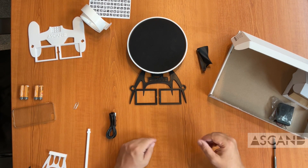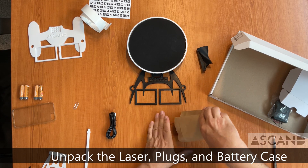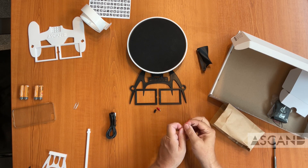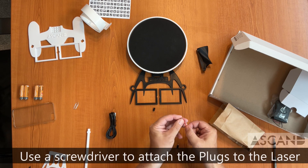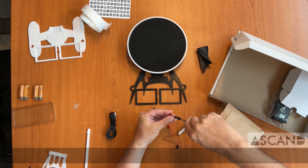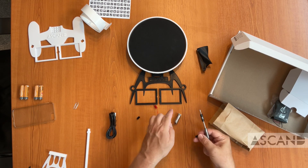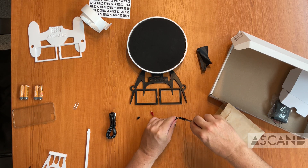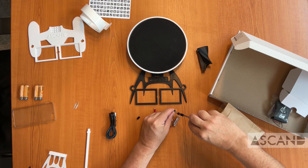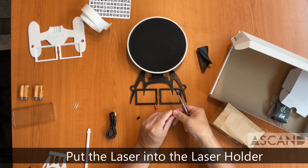Next, get the laser attached. Grab the little brown bag and take the laser out — there are also some plugs and plug connectors in there. Using a small screwdriver — really the only tool you need for the whole process — attach the plug to the laser cable. Make sure it's nice and tight and pull it a little to check it's well connected. Do the same thing for the black plug, attaching it to the black cable. Once done, check again that everything is tight and not coming off.